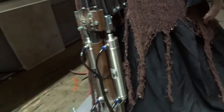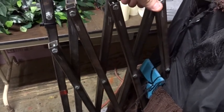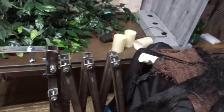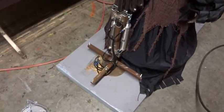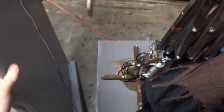On this particular scissor hinge there's a lot of weight to it, so I had to use two cylinders to get a quick enough push. The scissor hinge itself is fairly basic — I just modified it a little so it actually points upwards. Instead of making all the rods even, I cut one shorter so it kicks upward. It's got about four sections of scissors, each roughly 19 inches long. This whole apparatus has gone through many different designs since the beginning.